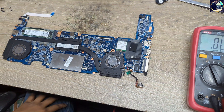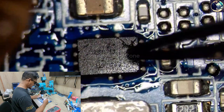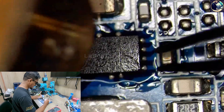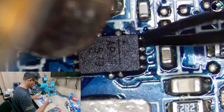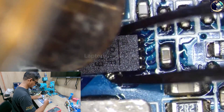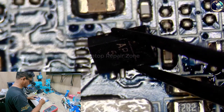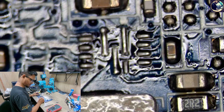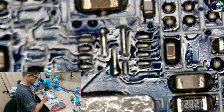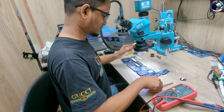After removing the controller IC, I will check whether this short is cleared or not. So before injecting voltage from my power supply, I'm removing this IC and then I will check again. As you can see, it's still short — that means this IC is good, so I will put it back later.